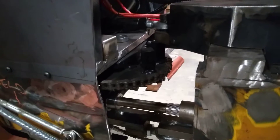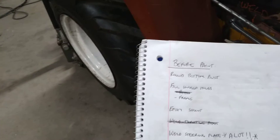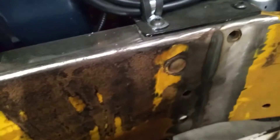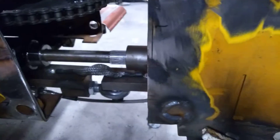That's all going to come during the disassembly. I've made a little list of stuff I need to do. First, round off the bottom pivot — it's just a solid chunk of flat bar on both sides and I want to knock those corners off and smooth it. Also, there are all kinds of unused holes in the frame that I just want to weld shut to clean it up — being careful not to close ones I still need.